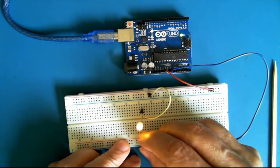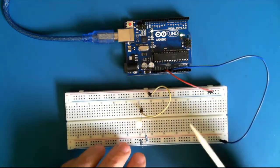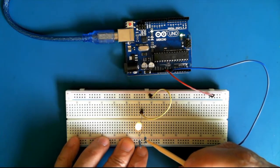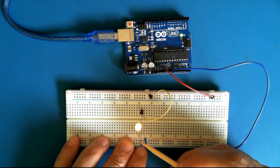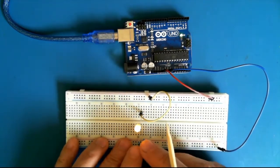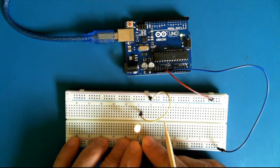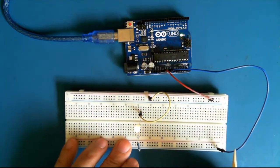And there's a property with electricity that says that if you're talking about resistance, half the electrons will go through this resistor, and the other half of the electrons will go through this resistor, and overall, you are providing a resistance which is about half of what it would be if you just had one resistor.